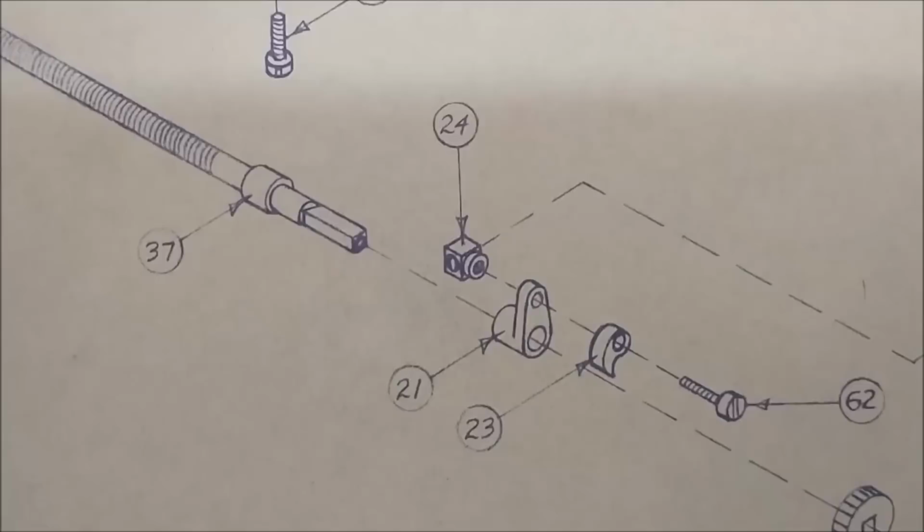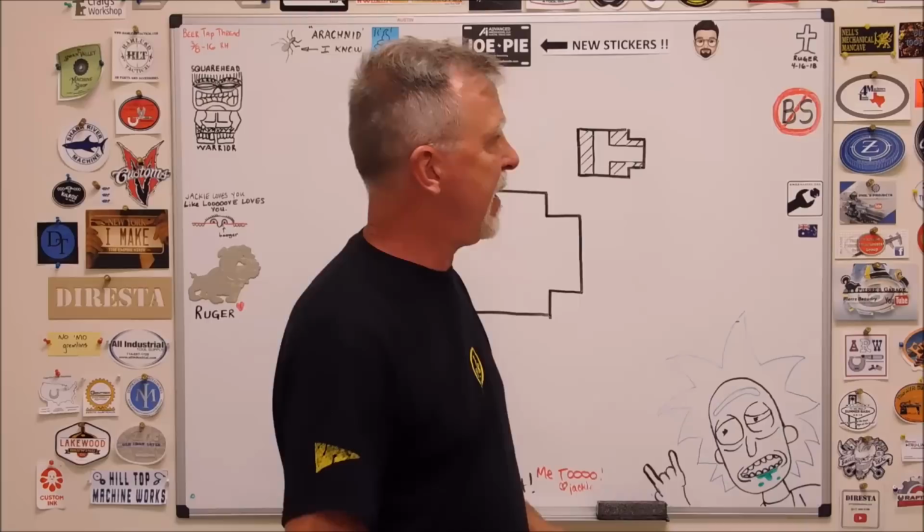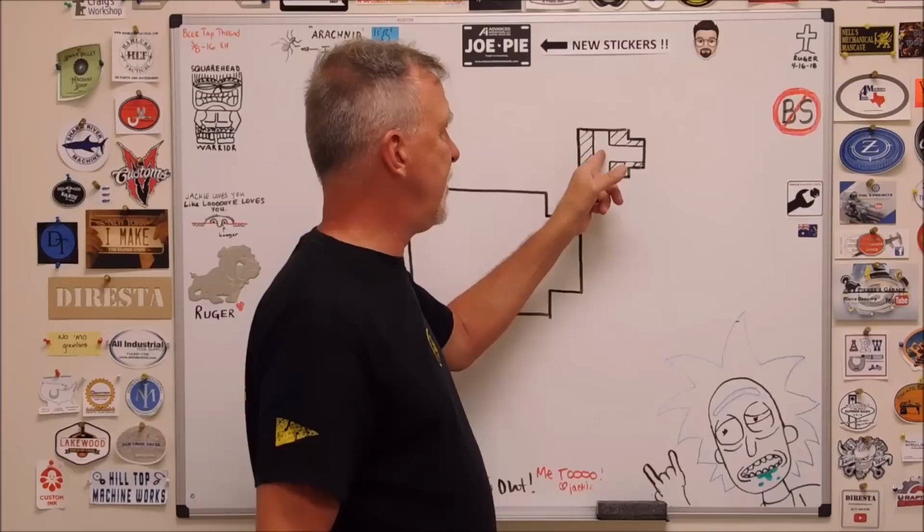When drilling a component with intersecting holes, you need to think about exactly how the drill is loaded up. Although this part is small and the holes intersect at a 90-degree angle, they're not always going to be small, narrow, short, shallow holes, and they're not always going to intersect at 90 degrees. So here is the cross-section of the part when it's complete. The front is drilled to a certain depth, threaded, and then there's a cross hole for the rod.